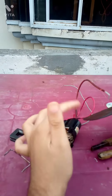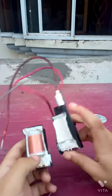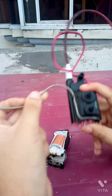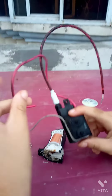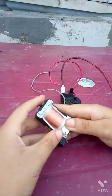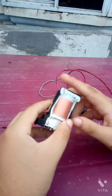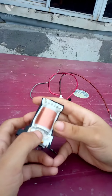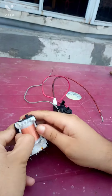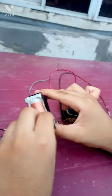Now you can see after breaking it open it looks like this — there is a winding with plastics. This is the main part which contains two potentiometers: one is to adjust the screen voltage and focus voltage. The high voltage lead is drawn from here. These are very fine windings with a couple of turns with plastics. There are quite a few pins inside, and there are multi-layer plastics inside. The outer casing is made of ceramic or epoxy material.